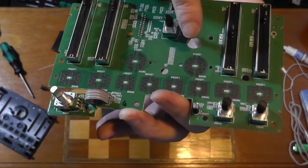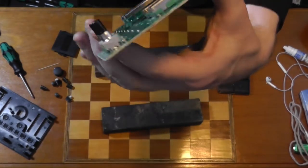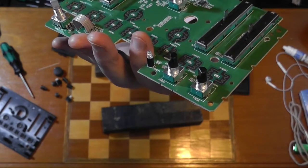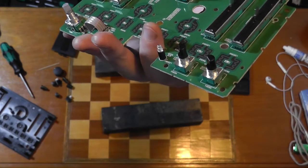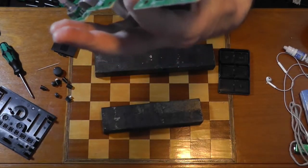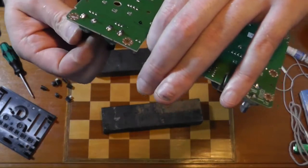We've got capacitive switches, and we have these faders — they look quite standard. What sort of values are they? They're not marked; they just say VR and numbers, so you'd have to see a circuit diagram to know the values. These two are continuous and these two are centre detented. They're through-hole. These pots are all through-hole too.